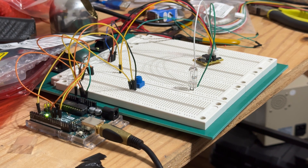I'm going to have my customer test this a little bit — make sure the hysteresis is good for him and the engage and disengage points are good, especially in traffic situations where you're bumper-to-bumper and you don't always want it turning on and off constantly. We can adjust the firmware as needed and get these up for sale. I know a lot of people will benefit from this, and people have been asking for it over the years. I'm pretty confident they're ready for sale now.